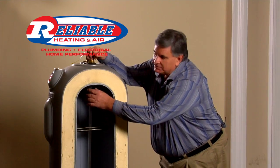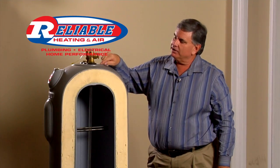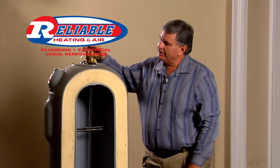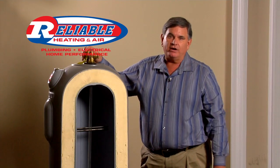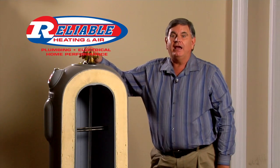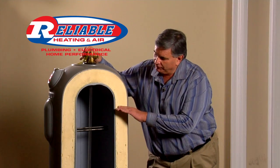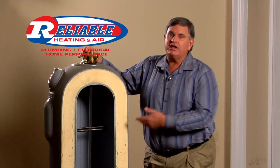When the dip tube is broken or falls completely off, cold water comes into your water heater and mixes with the hot water and goes right out. A symptom of a bad dip tube is within just minutes of starting to shower or bathe, you'll notice the water getting colder and colder, then finally tepid and then freezing cold. There's still 40 or 50 gallons of hot water down in the bottom of the heater — you just can't access it.